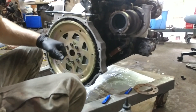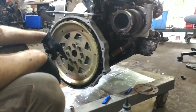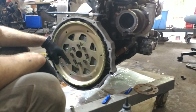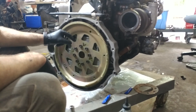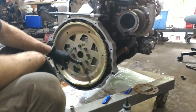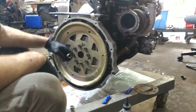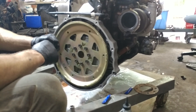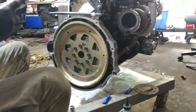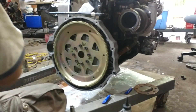The reason why we said go hand-tight: on the black hole project that we were doing, there is one bolt that was trying to strip. It could probably have been prevented if somebody had just taken a little bit more time to make sure that it was in there properly, whether that was myself or somebody else. It happened, so take that extra moment to hand-tighten carefully before running them down.